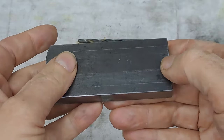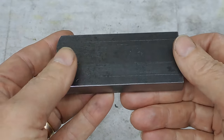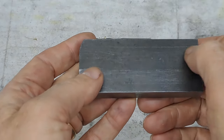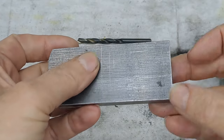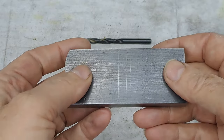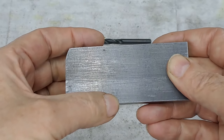Drill those two holes, and then change to the big cutter, and up and down, up and down, which will be probably 30, 36 times, just in the beginning to get rid of the middle bit, and then smaller cuts just to tidy up the legs of the U, the base being over here, so that it all ends up 6 mil. These two legs end up both the same at 6 mil wide. This is 40. And then it'd be a case of whopping this bit off with a hacksaw or on the bandsaw, probably a hacksaw.